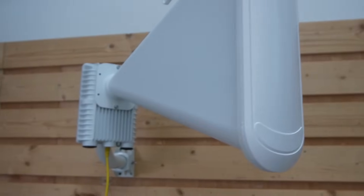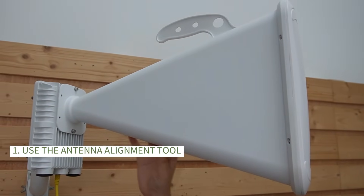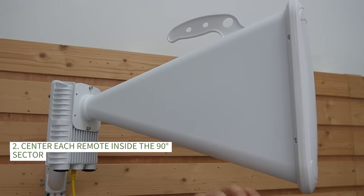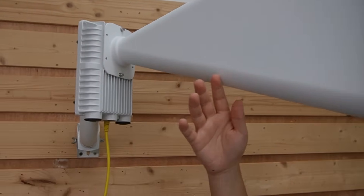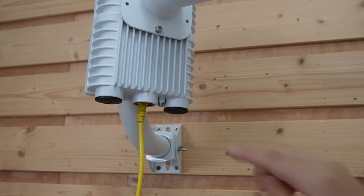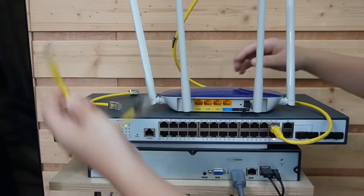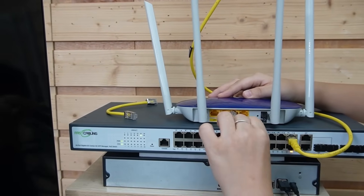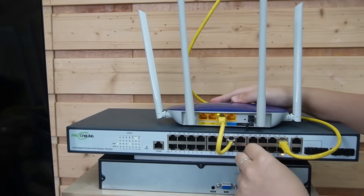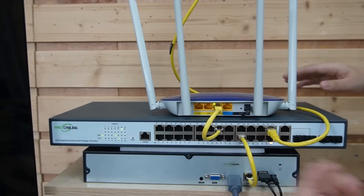When installing the wireless bridge, small movements matter. Use the alignment tool at the master and the remotes to center each remote inside the 90-degree sector. As you can see, all our remote units are inside the target degrees. Wait for the reading to settle, then tighten it. This is already connected to our PoE managed switch for power. We're going to use a short patch cord to connect the router to our managed switch, and from our managed switch to the network video recorder.